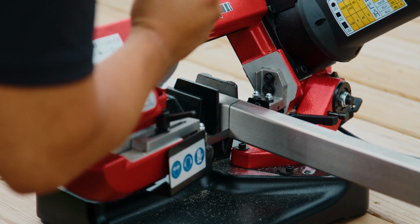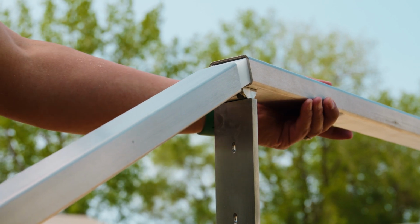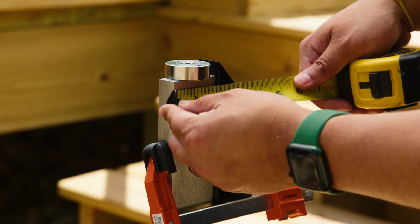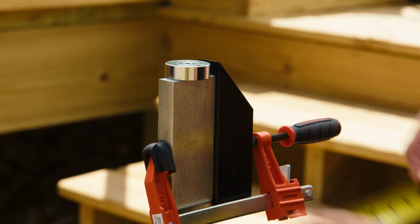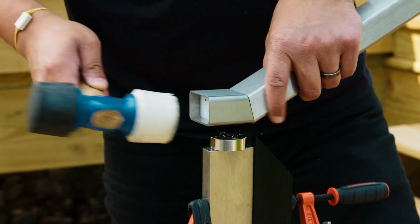Lastly, we will need to build some custom splines to hold these joints together. We've covered how to make these splines in a separate video. Hit the link at the corner or in the description to check that out. From the inflection point to the end of the post top, the spline will measure 1.5 inches. This will involve cutting through the screws that hold the spline together.